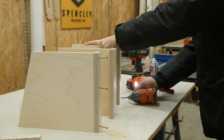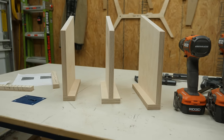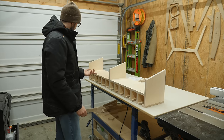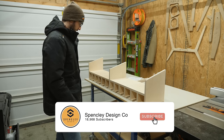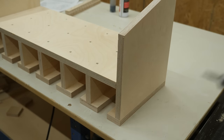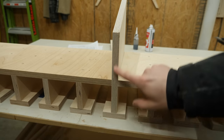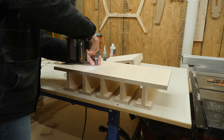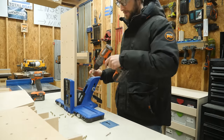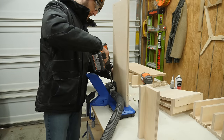These three vertical panels need some tool supports attached to the bottom with screws. Just make sure that the outside two pieces are mirrored. With those done, I can attach the center shelves to the vertical pieces — but wait, that's not going to work. I didn't think this one through. The outside pieces would be easy, just fire in some screws on the side, but the center section has no way to connect with a basic tool set. So I had to backtrack and remove the T-sections from the center shelf to drill some pocket holes — and I messed up again, not factoring in the clearance needed for my drill. Luckily I could pop off that last T-section and finally get to drilling those pocket holes.